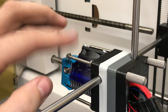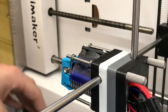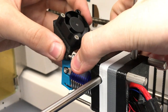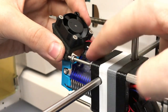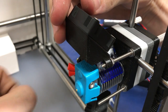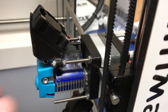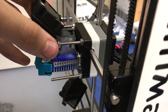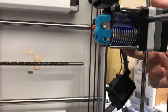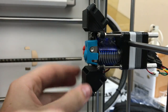You want to take a nut, thread that on, and then add on a washer. Repeat that for the second one. You want to take your print cooling fan and put it right here. You may want to squeeze these two screws together — it helps getting things fitted — and you'll have to move this out of the way too. Now you have your print cooling fan installed. You want to add a washer onto the threads and then another nut. After adding the bottom nut, also tighten the top nut with a pair of pliers. Now that the top print cooling fan has been installed, we're going to repeat the process for the bottom print cooling fan.